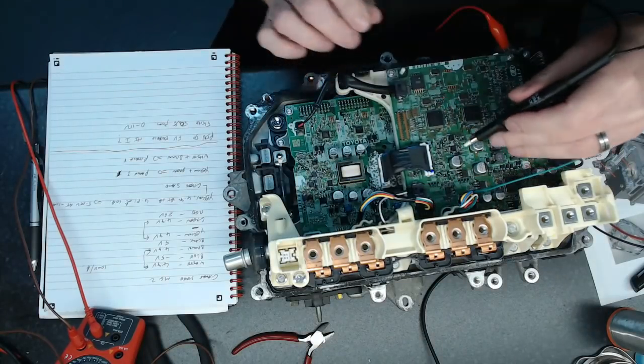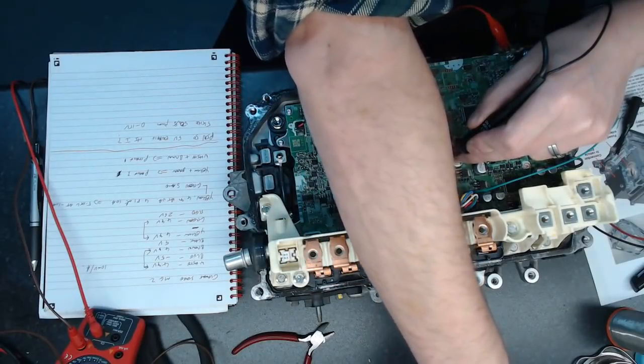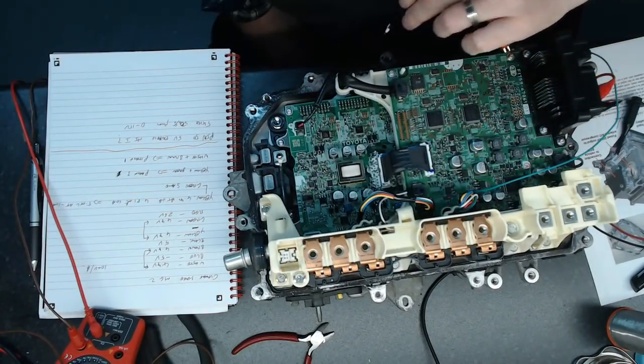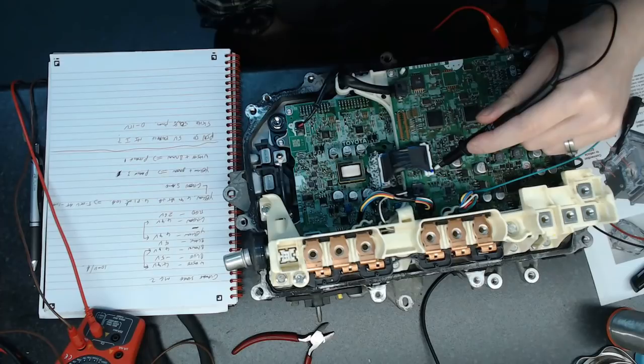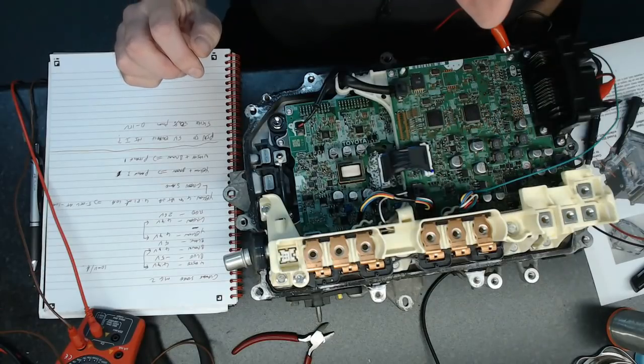Okay, hang up, guys. Let me get you on here. That's weird. That's weird and wonderful. Okay, so there's my 5 kilohertz PWM. Let me just ground the probe a second. Okay, so what I've got here is a square wave. It's a 5 volt square wave, but it's sitting up on about, what's that, 2 volts per division, about 1.8 volts. It's actually sitting up on it. Those are my 6 PWMs. 6 PWMs, I think, are coming down this line here now.